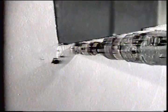Now, the second step, after doing that, is to set your microstop to the appropriate depth. And pick a microstop that has a 3/4 inch diameter on the end. If you don't have one, machine it to 3/4 of an inch so that it will key in. The amount of material that you will remove from here will be substantial enough that you might lose the pilot. And if you do, you will lose your reference. That's why it's so important that when you're done, you counterbore at the right depth and you countersink at the right depth.